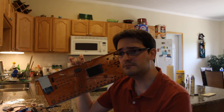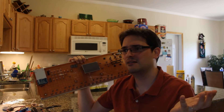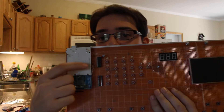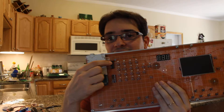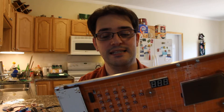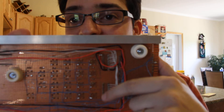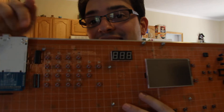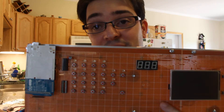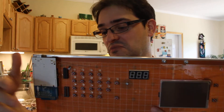I uncommented it, ran the thing, and got another surprise — it would display the graphics but there were glitches. Was I really breaking it? Turns out, these two chips here are 574s to hold the values for the LED array when the bus is doing something else. If you look at the back, the first one has power hooked up but the second one has nothing hooked up. If you have a chip that's unpowered when bus information goes through it, it freaks out and distorts things.